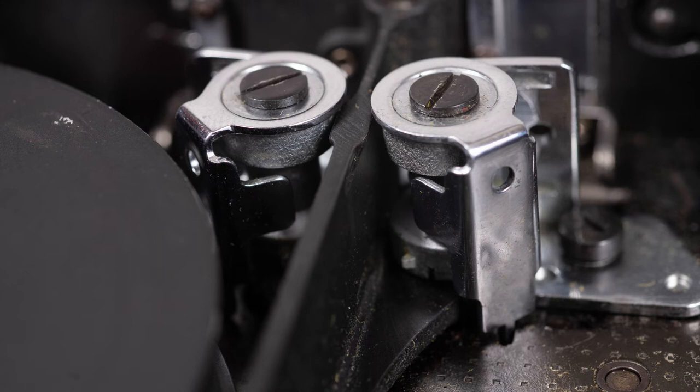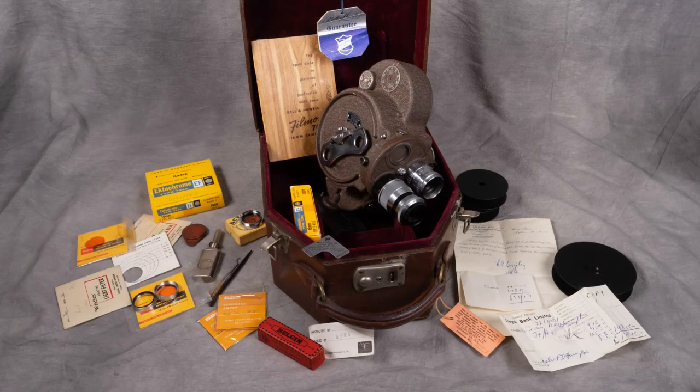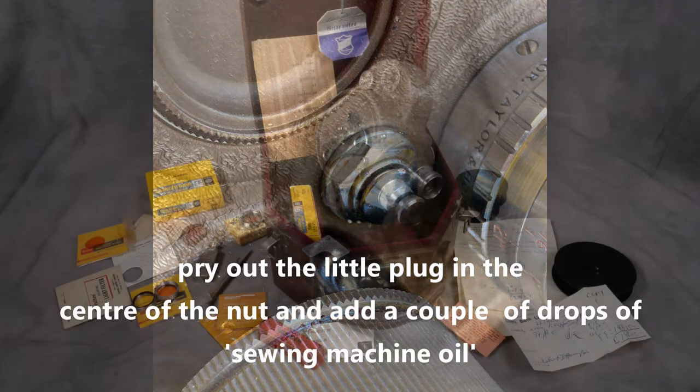When it arrived, I tore the packaging off quickly and wound the camera to test it. After making the rookie error of not having the lens in line with the shutter to unlock the mechanism, the camera fired up and the motor made an absolutely unholy screaming. Luckily I'd read up about common issues with Filmos and realised it only needed a lubrication job. I oiled the internal oiling points inside the camera and removed the plug on the lens turret that allows oiling of the shutter shaft, and with a bit of working this camera started to fire up and purr, just like the first one.